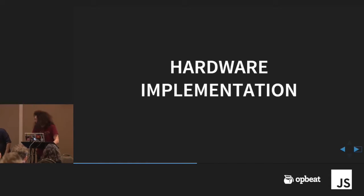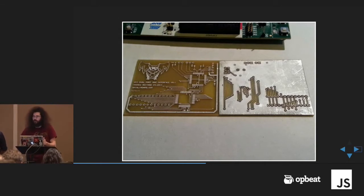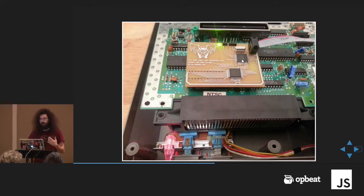Andrew's going to talk about how the hardware works. This is the board actually installed in the NES — just the bare PCB, but the architecture is pretty straightforward: a microcontroller talking to the dual port RAM. What dual port RAM is: it's static RAM, but instead of one set of address lines and data lines you have two, and they can both operate at the same time, with internal arbitration logic on the chip handling write precedence. What I did is I pulled the original RAM chip out and put my board where it was. One port maps directly to the NES, so if nothing else is hooked up the NES would still operate normally — but now we can read and write it while it's running with no interference at all.